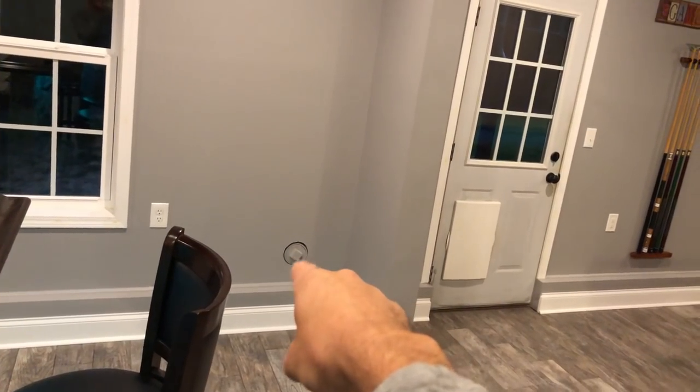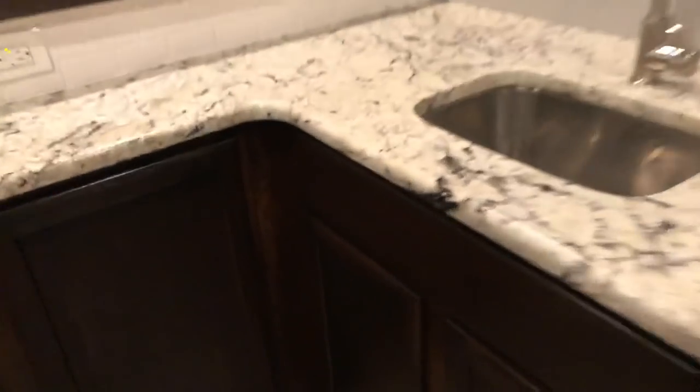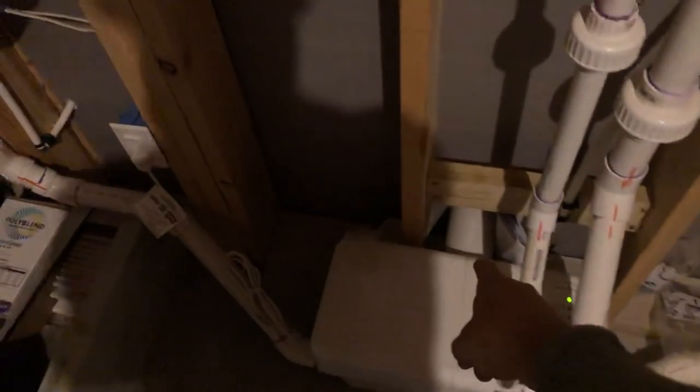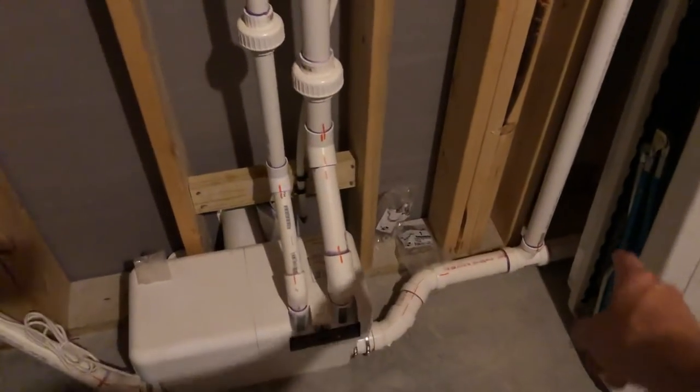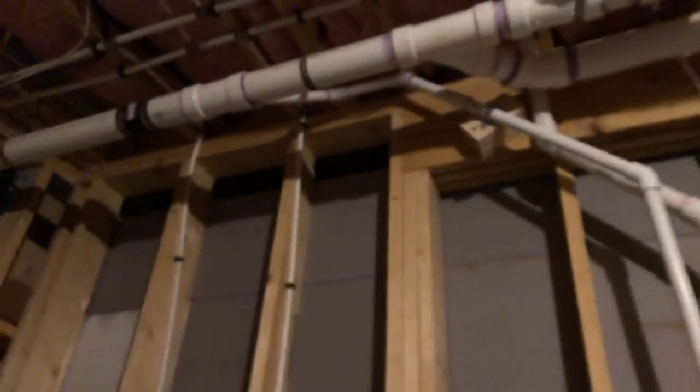The toilet, bar sink — all my plumbing — my main drain line comes right through here and down, and you can see the drain clean-out I haven't covered yet. There's a sink pump and laundry pump up under here. It goes through a check valve and basically pumps it up, which allows me to get up to the main line. The toilet is essentially the same thing but it has a macerator in it. The back of the toilet comes right in here — macerator with the pump. The vanity comes in here, the shower comes in here, these big lines are vents, and this little one-inch line is where all the waste comes up and ties back into the main line.